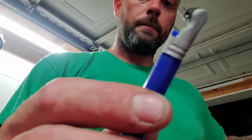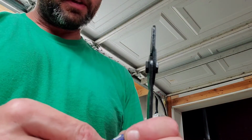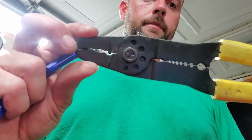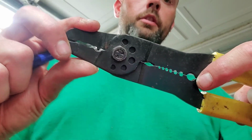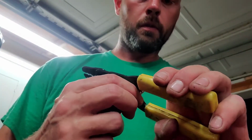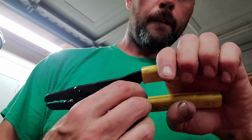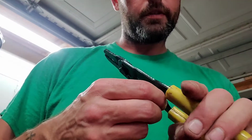What we're going to do at that point, granted, I'll tell you, I've never done this with such a big set of wires either, and I didn't get it indexed perfect, but whatever, man, I'm close enough. So these are cheap, they're crap, but they got this hole right there. That's kind of what you're looking for. You want that hole right there. There's 2 indentions on these, and as you squeeze these, you put one in one indentation and squeeze them pretty good.